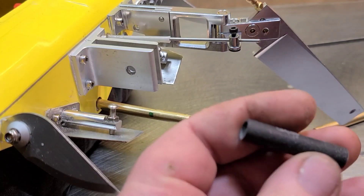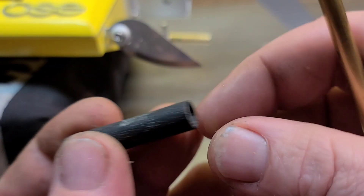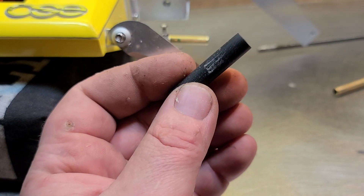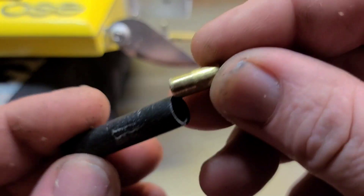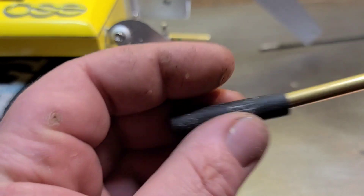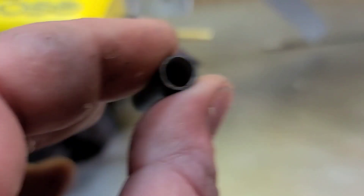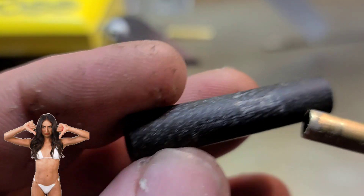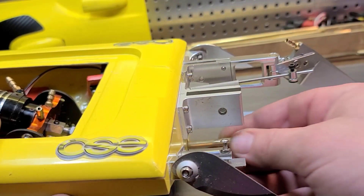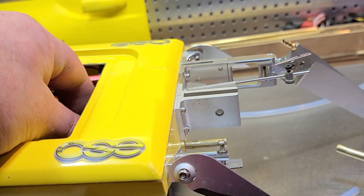I was really wanting to do a flooded stuffing tube — I cut it down to size and was working on an aluminum piece that the stuffing tube goes through, which would have given a lot of up-and-down adjustability. I was drilling it out a little bigger for more movement, but I had a pair of pliers on it and cracked it. So that's out. I've got a good length here and I know how long I'm going to make it.